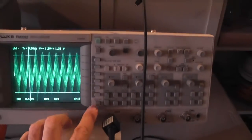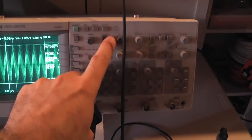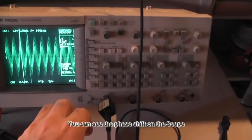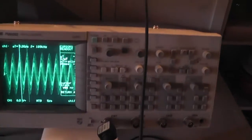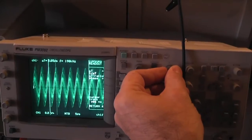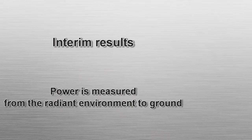Just for the sake of argument, you want to see the frequency — let's have a look. It's around 189 to 200 kilohertz. So 200 kilohertz — that is my calculated resonance frequency of this Tesla coil, and that's confirmed here.